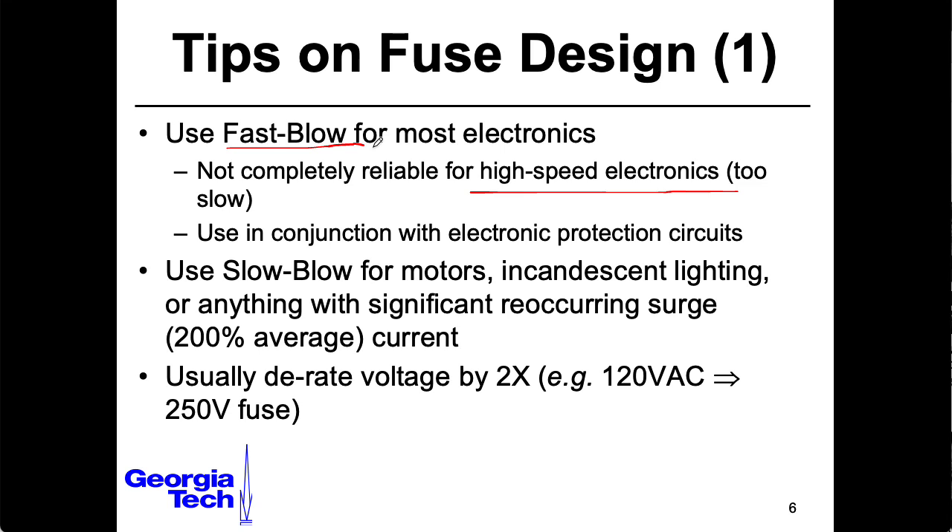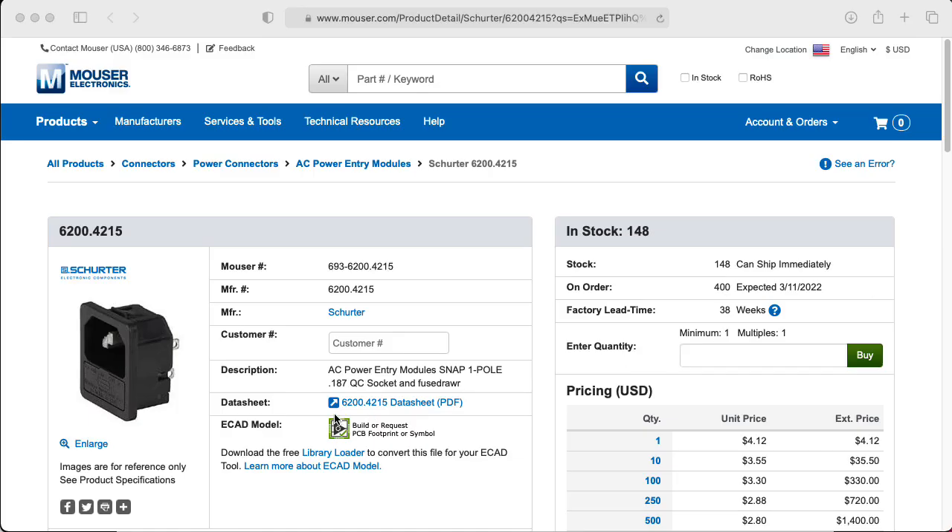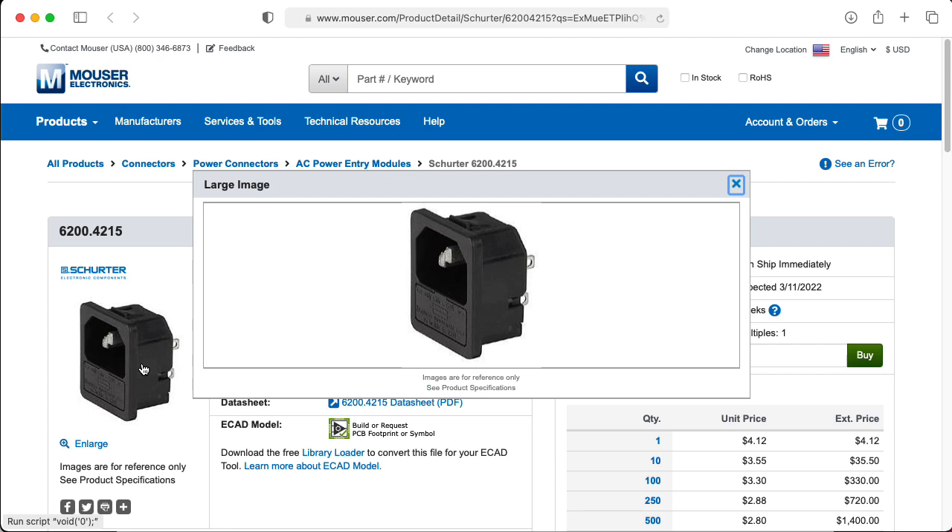In terms of the voltage rating, for wall current a good rule of thumb is to double the mains voltage. Sometimes people put the fuse on the PCB itself — you want to place it somewhere accessible without removing a bunch of other stuff. Some old Tektronix test equipment had a second fuse holder next to the main one, not hooked to anything, just to store a spare fuse. My favorite placement is a hatch accessible from the outside, using a standard IEC power connector with a built-in fuse holder.